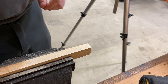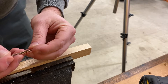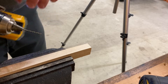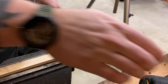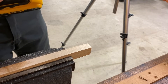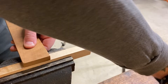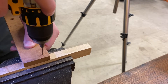When it comes to these screws, we've got an additional thing that we need to do. Number one, we're going to select a pilot bit that's appropriate. I've chosen this size bit, which is 1/16th — just slightly smaller than the shank, and that's going to work for us. We're going to go ahead and chuck that in the drill. You have to be very careful with these small drill bits — they're very, very slender and will snap very easily, so when you're using the drill, you don't want to be flopping around or bending to the side. We also need an appropriate countersink. This is the countersink, and what it does is create that cone shape in the hole. We're going to put that inside the driver and prepare to attach our piece of wood. Just like before, we're going to drill a pilot hole — straight down. With these smaller bits, it's even more important that you pop the chips out regularly; that's how you bind them and snap them if you're not careful.